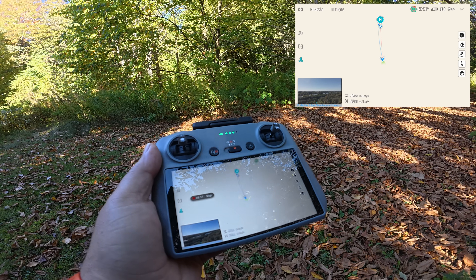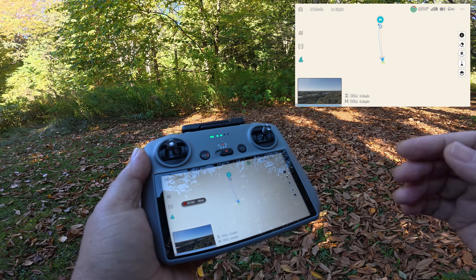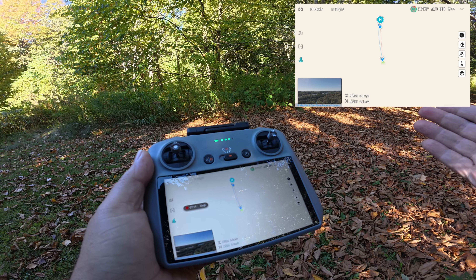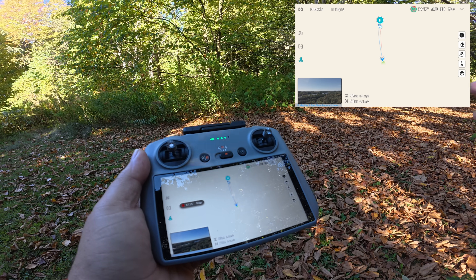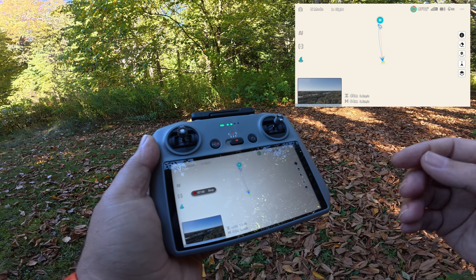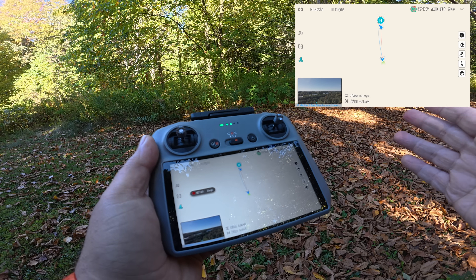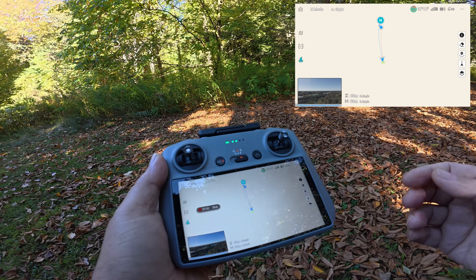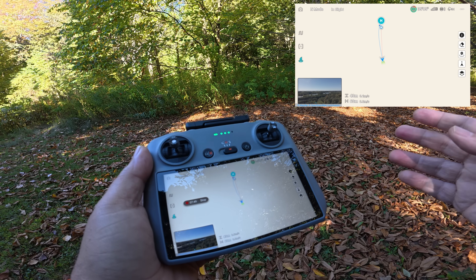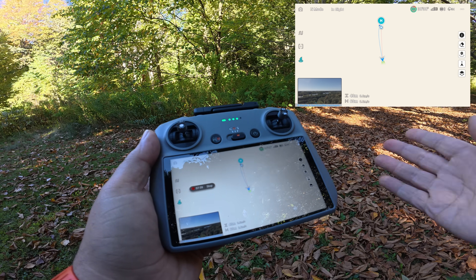Now I'm going to demonstrate this in a minute — we're going for a walk. An important thing to note is that when you have a dynamic home point set, it behaves a little differently than a normal return to home. In a normal return to home, the drone comes back fairly accurately and automatically lands. With a dynamic home point enabled, in the event of a failsafe or manually initiated return to home, the drone flies back to the dynamic home point and then just stops and hovers in the air. It does that because it doesn't know the terrain — you could be on water — so it comes to the general location, stops, hovers, and you have to manually land it.